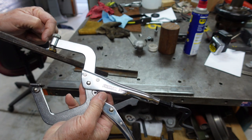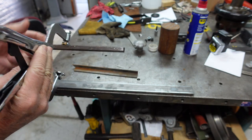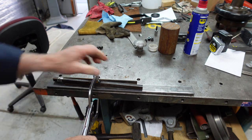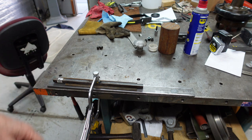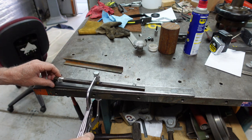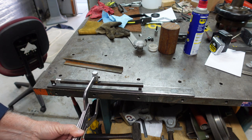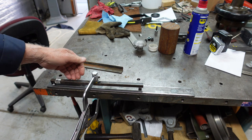I've run the bolt through the opposite direction and into a nut. What we have is a 12-inch bar. Thinking that the 12-inch bar could be used for clamping in a scenario like this — now you're getting pressure all the way across the piece. I was also thinking of putting little feet underneath it, welded onto the bar, where you would have point pressure further apart.